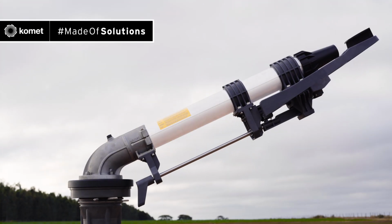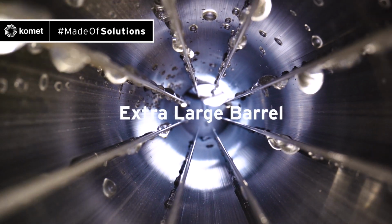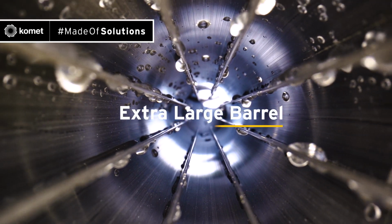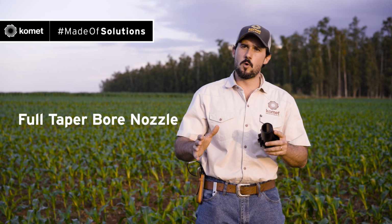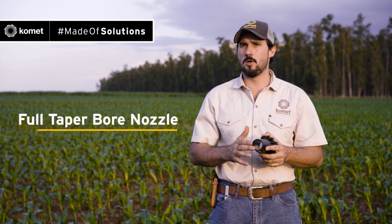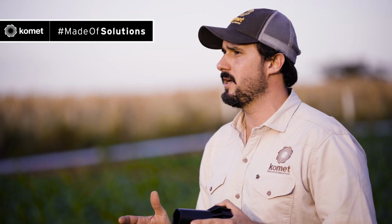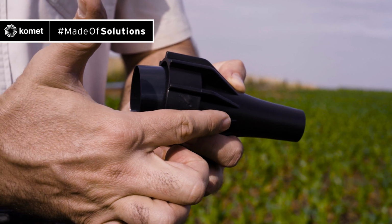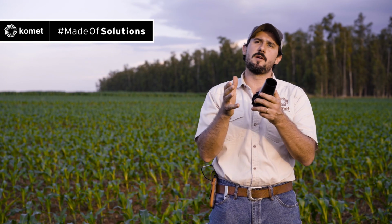Thanks to the strategic positioning of the straightening vanes inside the Twin Ultra Barrel with an extra large diameter, the water reaches the nozzle with the least possible turbulence and pressure losses. What is more, the extra long full taper bore nozzle allows to reduce the diameter of the water stream as smoothly as possible. The nozzle actually already starts inside the barrel. This way, the water can exit the nozzle in a very smooth and perfectly cylindrical way.